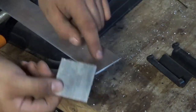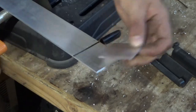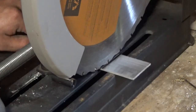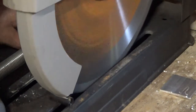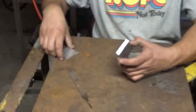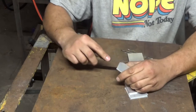So now to get a little bit better measurements or cuts, I'm going to put it on here sideways like this. Draw my line and remember to set the saw blade to take off the whole line. And now repeat as necessary until you get six pieces, because a cube has six sides to it. So now I've got all my pieces cut, all six of them. File them down and take all the burrs off.